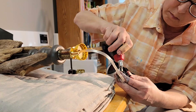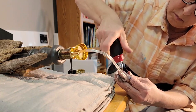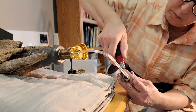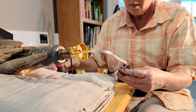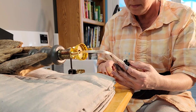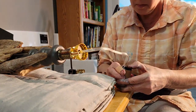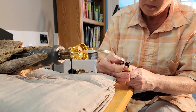There are directions on the cord and on the socket on which way you need to wire this. And on all cording, one of the wires has a ribbed area going all the way around it. This has to do with the polarity on where you hook them up on the top of your new socket. But follow the directions on the one you get, and it will tell you for sure. And also, save the old one so you can look at it and reverse engineer it if you have to.